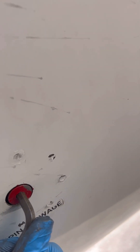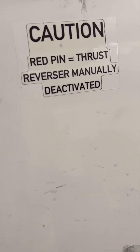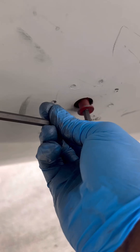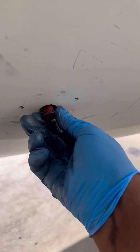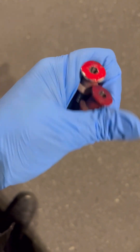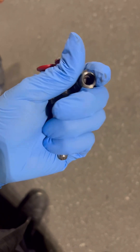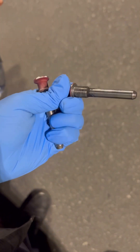Let's take out the pin from its storage. To unscrew the lockout pin from storage, we use an Allen key. After it's loose, we just take it out. These are both our thrust reverser lockout pins and plugs — the pins are painted red for visibility so that when they are installed, during walk-around, the crew can see that the engine thrust reverser is deactivated.